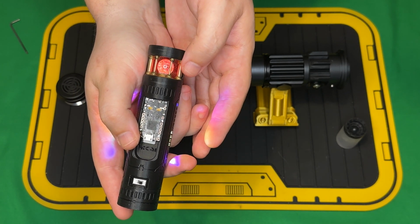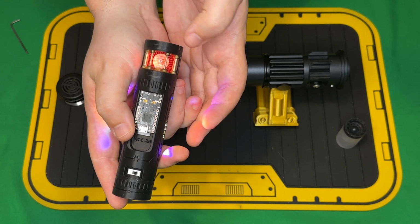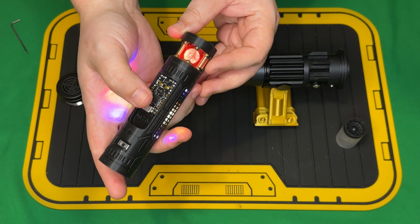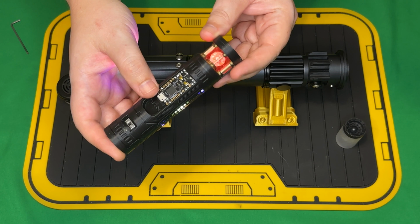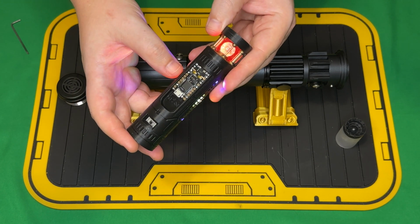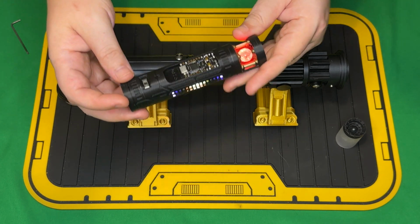And then the cables run up these 2 4mm outside posts, and the two 2mm inside posts are just for support. We've got a Proffie V2 high amp kill switch. The config is on the SD card. This is sporting mostly Syndicate Relic custom fonts. I believe there may be one Kyberphonic font on here.